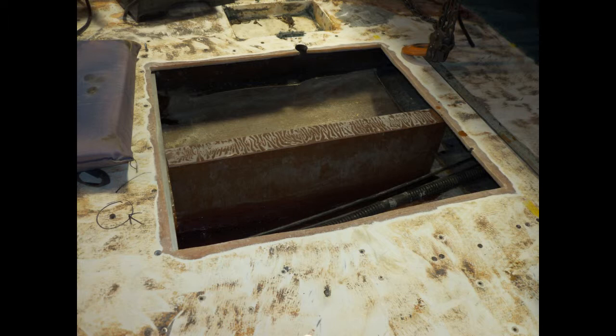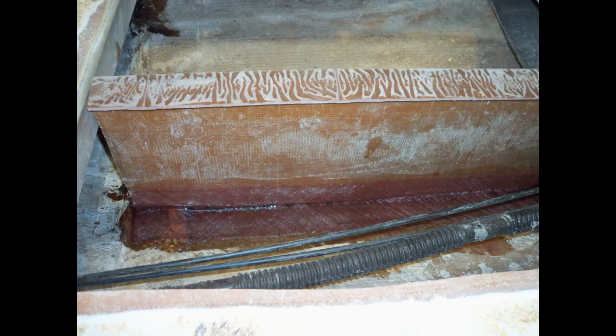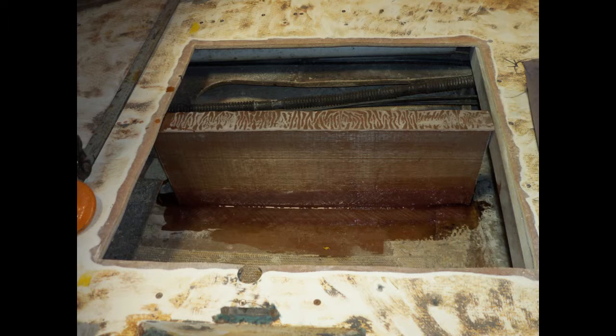You can get creative and do this with plywood, but it would need to be sufficiently fiberglass to protect it. This is a half-inch foam core with 1708 on both sides of it and then a beam across the top. After the bilge area has been completely ground and prepped for glasswork, we're going to put a couple of applications of 1708 tape in the bottom, also supporting the edges of the front and back of this opening.